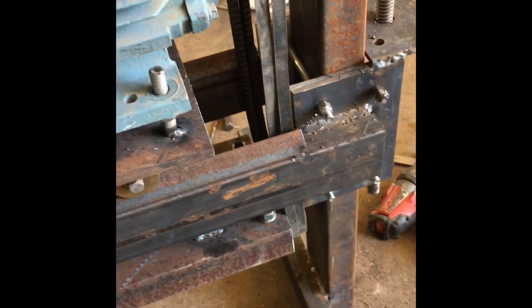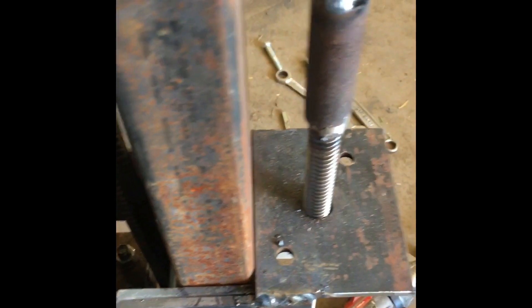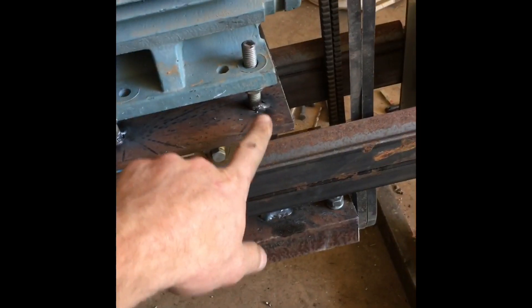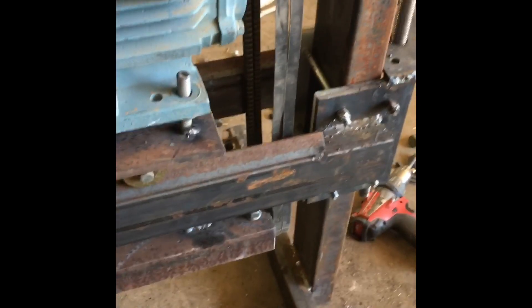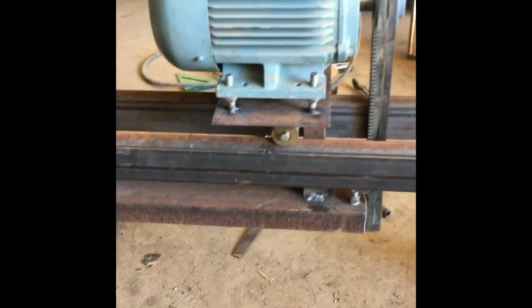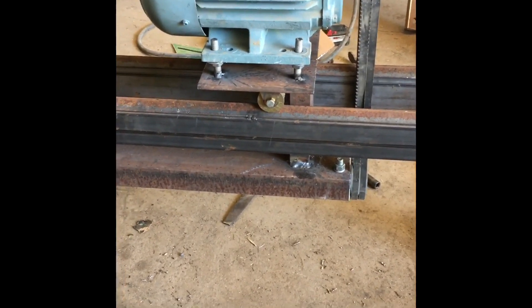This whole assembly will slide. These belts obviously should go in there — something I'm going to have to look into, but they're really loose, they're the wrong size, just something I found laying around. I'll have a simple stud going up with a nut underneath to tension everything. Because it's a 20-inch planer head, this is going to slide back and forth and will allow me to plane 36 inches wide, which is what I can cut on my sawmill as well as run through my wide belt sander. I thought about going bigger but figured I'd stick with this since it matches my other limitations.